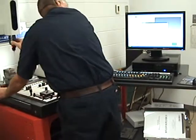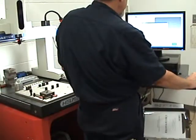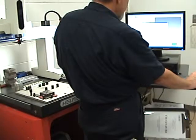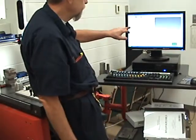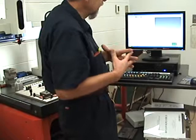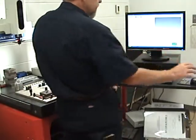That should be it. The last probe I just checked was 117 and a half thousandths — that's about what it should be. So I'm going to say set active. Now it's going to put that probe right here — that's the probe I just calibrated. Usually you want to calibrate a probe three or four times just to make sure it's right because of temperature changes and things like that.